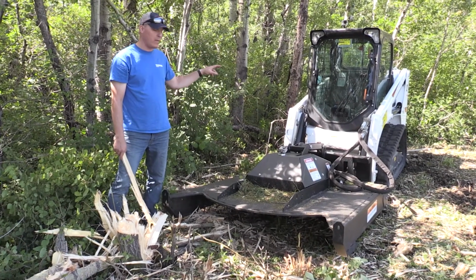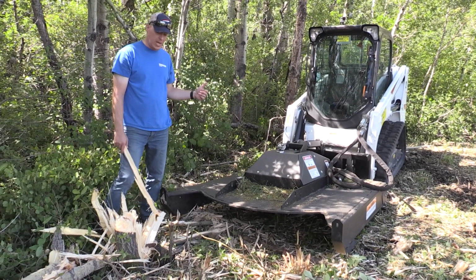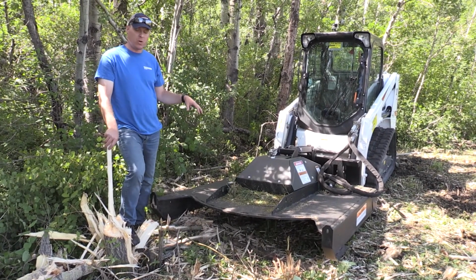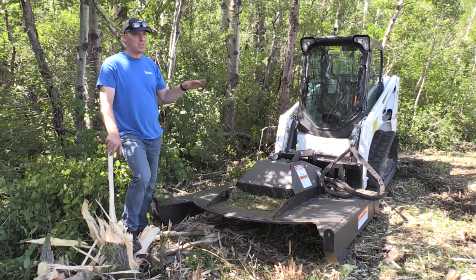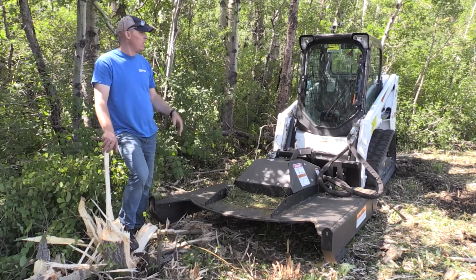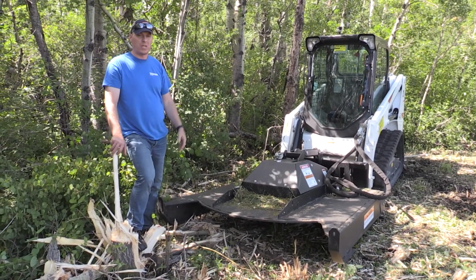The power in that skid steer is remarkable. I think it's about 60 some horsepower, and it's only pushing 16 gallons per minute. But when we match the motor to that flow rate, you can see what we can do with this mower. It's amazing with a 60-inch mower what we were doing out here. I was mowing grass wide open with the sticks all the way forward. So I was probably traveling 6 miles per hour. And even with the saplings here, I was able to travel over 3 miles per hour mowing down 1 to 2 inch saplings.